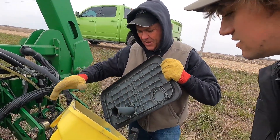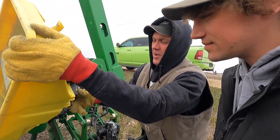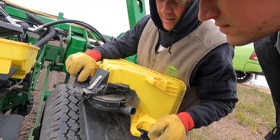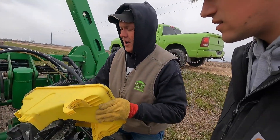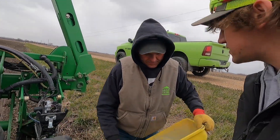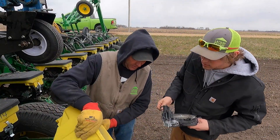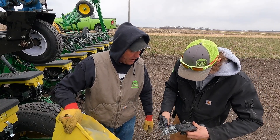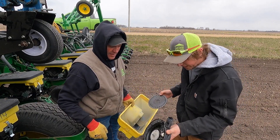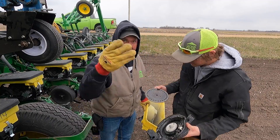Our fertilizer hose being off was a very bad thing. Be a farmer they said. The fertilizer got inside everything and it's causing trouble. Wait till you see it. Oh I see it right now - that's all sticky fertilizer. And the motor can't even turn that thing. All right, we get to go home and take that whole thing apart, wash it up. How about our hand wash station - would that be enough water? We got four gallons. We're gonna have to go home, get the air compressor, dry this up after we wash it. Oh my god, we sucked it up into the suction hole. We gotta go home, come on, let's go.